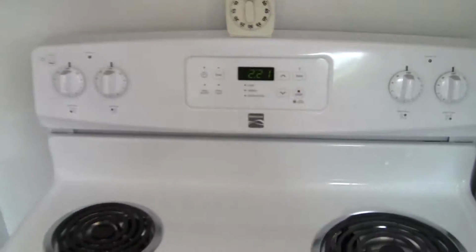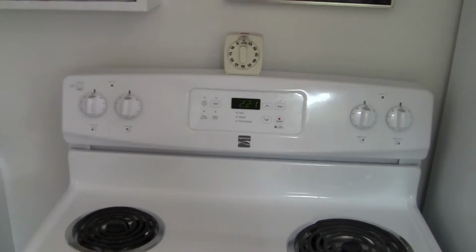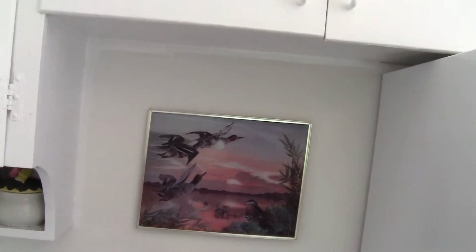And it works really well. Now over here I'm waiting to have the whole house done before I take out the stove and the refrigerator and get at the back of this. Another thing too is I haven't got this back wall, and you can see where the paneling has got some wood knots in it, where they're showing through right there. These are oil spots that come through with the wood, and the best way to fix those is to use oil primer on them as a blocking agent and then paint it. Because if you don't, eventually that'll worm its way right back up through there.